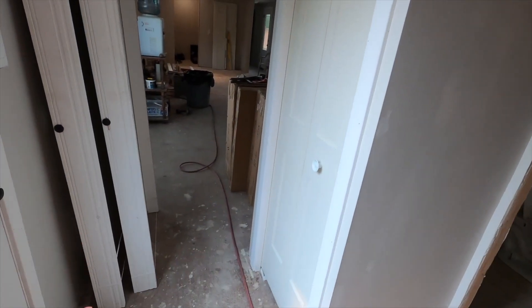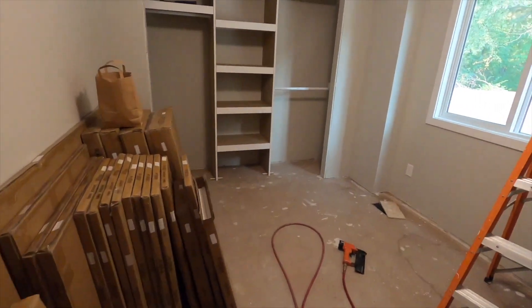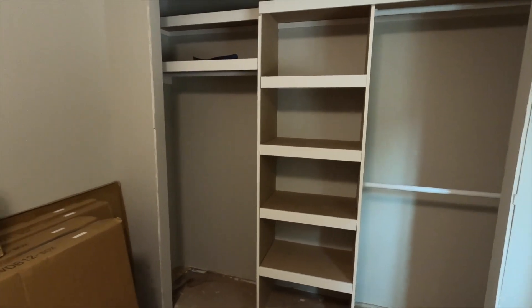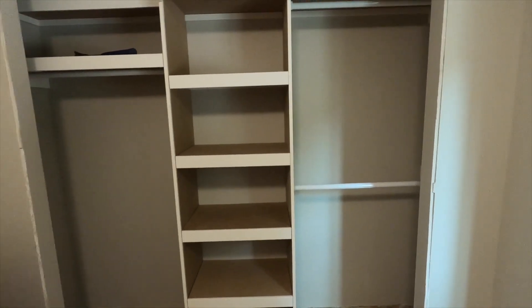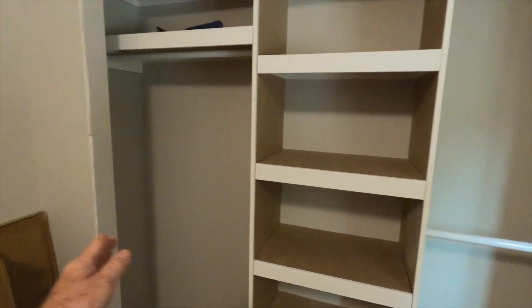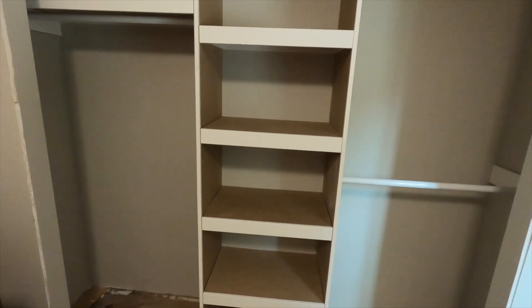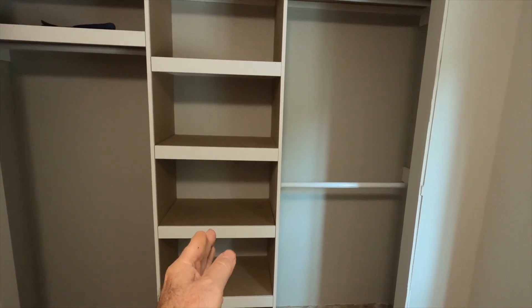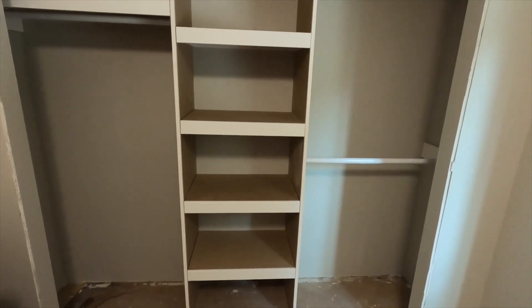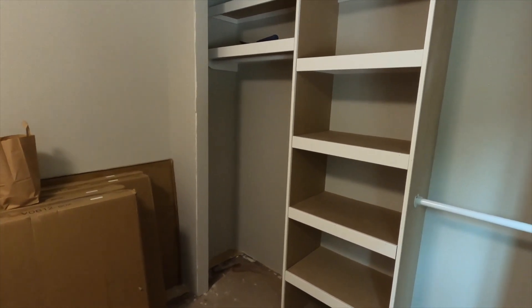In tight spots like we have here, you don't really have room to swing a door nicely. And in a room like this with a large closet, the sliding bypass doors only let you have half of the closet opening accessible at once — one door is always in the way. When you have shelves in the middle of the closet, you're never going to get full access with a sliding bypass door. So I've decided to go with bi-folds.